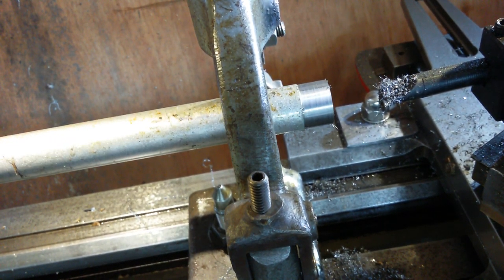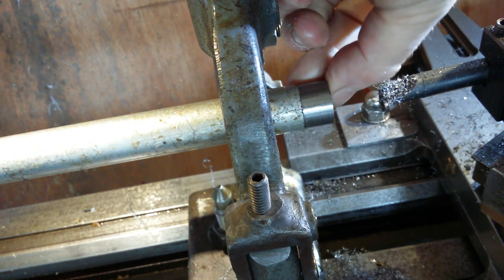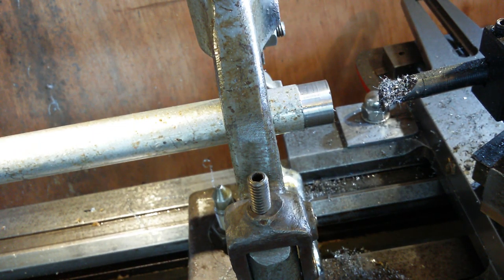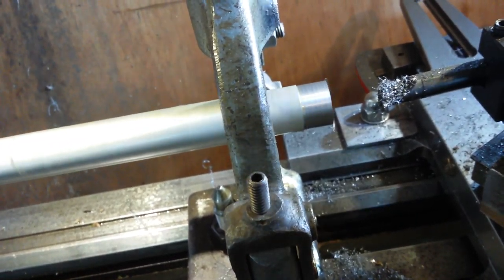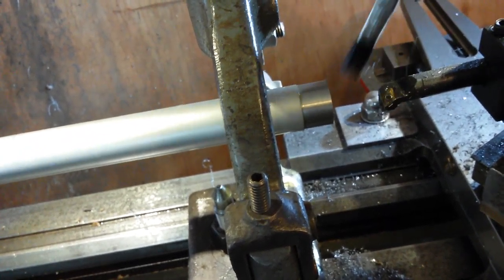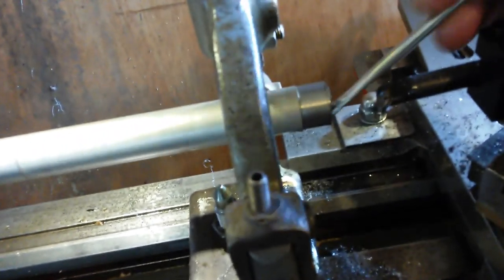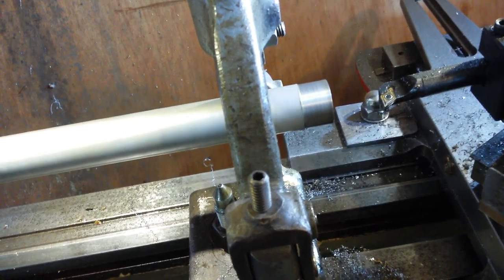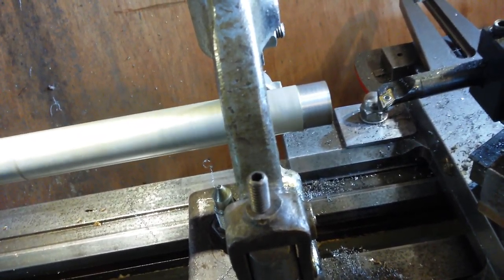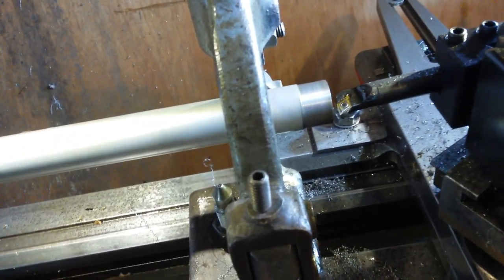Have success, nearly. Just got to take another couple of thou out of that. Unbelievably close. Wall thickness on this now is minute. Looks fantastic. So this will be the final cut. I'm going to put some oil in there now and clean the end off. And I'm going to put another cut through, and hopefully that is it.